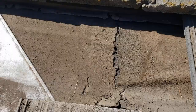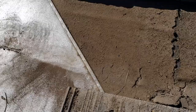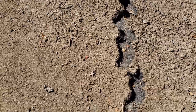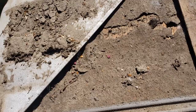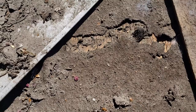This last little area we just showed you where the dirt and debris dammed up the metal — the rainwater is coming off the metal. You can see the result of having water sitting on this paper: it's all cracked open. There's even a bit of a dam right here across the top of this tile. Here we are at the bottom of the fascia, the last piece, and we finally found the culprit for why we're leaking water into the back of the fascia board. The paper is completely rotted out. It was all dammed up, water backing up onto the paper, got the paper all rotted out. So we're going to have to fix that and then button the whole thing back up. And that's what's going on in Royce's world today.